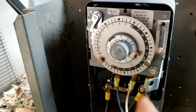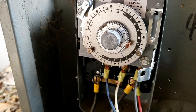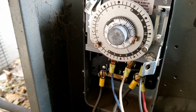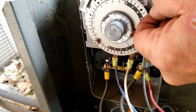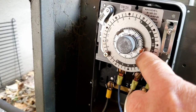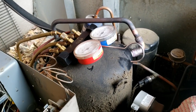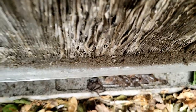I just now had a chance to look closer at this defrost clock - a little bit off there. Like I said, the time was off and may not do you a whole lot of good, so we're going to even those out - may actually take it to three defrost cycles instead of the two they had. They had a walk-in cooler before this which would have gotten a lot of the humidity out prior to the issues they've got going on. The timer is set pretty high too, and I don't know if the defrost termination is working properly either. It sounds like it's just basically accumulated ice, and between that and the refrigerant being low, we've got some progress to make here. The fins are a little mangled.